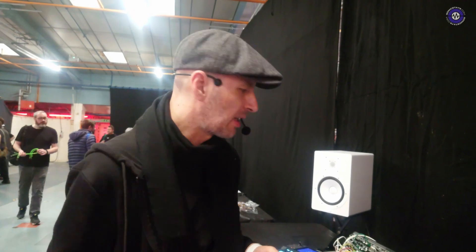We decided to eliminate the dreadful one volt per octave input because a free-running oscillator means nothing. If you're working with polyphony, you really need it — that's one of the hardest challenges to get everything tuned. So we started with mono voices and quickly realized it's actually very cool to do polyphonic patches, and that led us to creating polyphonic modules.